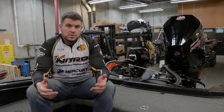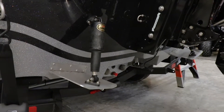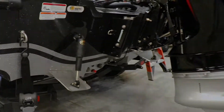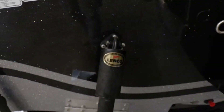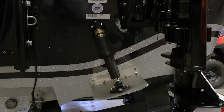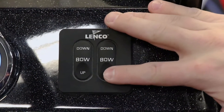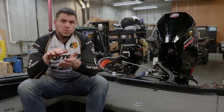One of the things that makes the Nitro boat an absolute game changer is the addition of the Lenco trim tabs. What they allow you to do on the water is to control basically the entire hull of the boat and how it reacts to the conditions you're in. For example, you have a 15 horsepower kicker on one side and a weight imbalance between passengers — the boat will often ride at an off-axis. The trim tabs are individually controlled, which allows you to raise one side of the boat or drop the other side, leveling out your load while underway. That also works well when you're in bigger waves — if they're blowing into the starboard side, you can drop the port side and raise your starboard side so the waves crash against the higher side of the boat, ensuring you and your crew don't get wet. While running directly into or with the waves, it allows you to drive the front of the boat down by lifting the stern, giving you a much smoother and flat ride across the water.